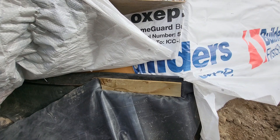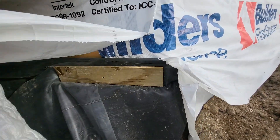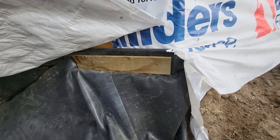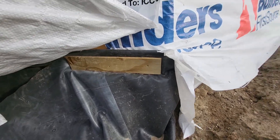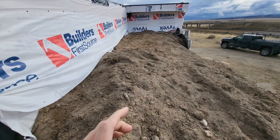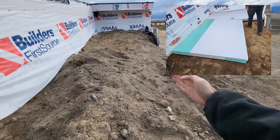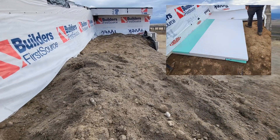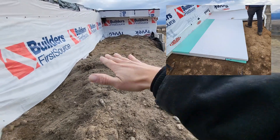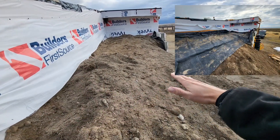That's just attached to the framing of the wall. Under here is the ICF. This is just the side wrapped around from over here, so there's a skirt coming all the way completely over the thermal wrap. We added four inches of foam board up there, as well as capping it with four inches of foam. And then we ran the EPDM over that.